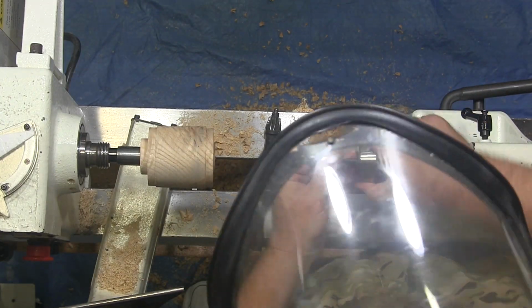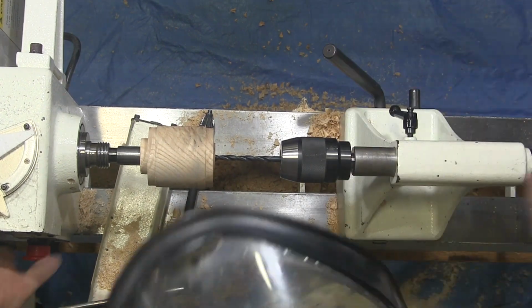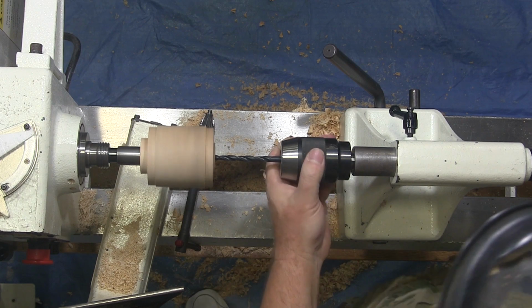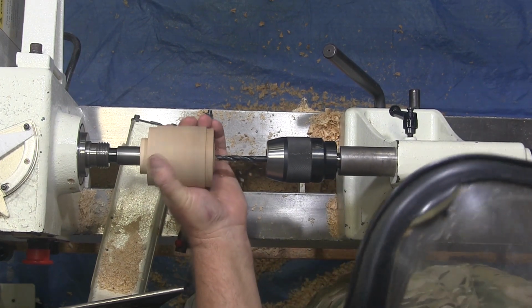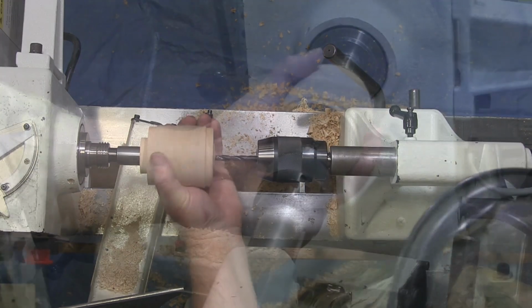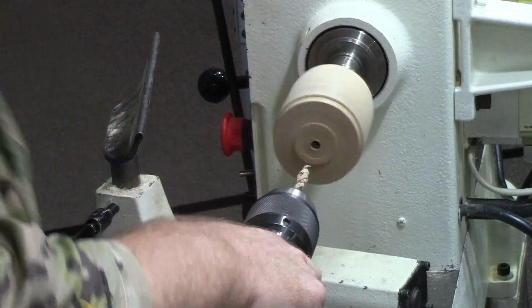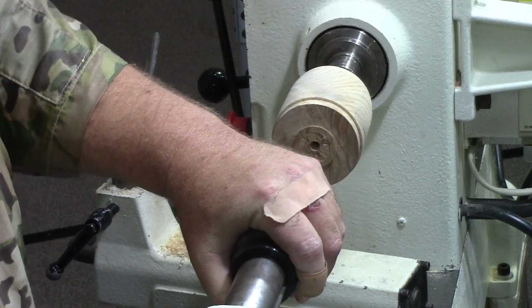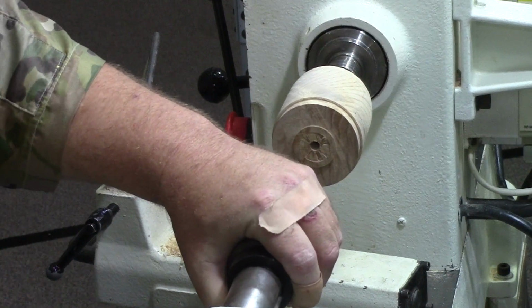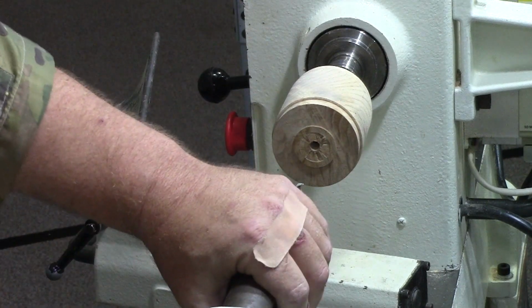I told you this was boring. Okay? Come back with the 9/32. I'm going to make those holes meet just like I did before. I'm a little off here. This happens in every demo, right? Okay? Okay, now, I'm not going to finish the cap today, but when I do, I'm going to mount this cap on this mandrel, not in a chuck.